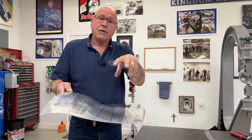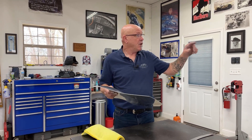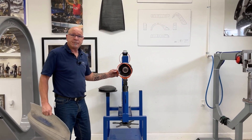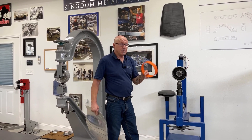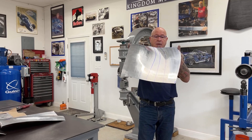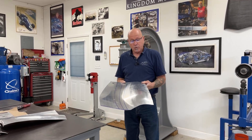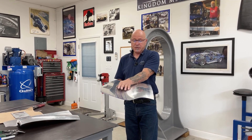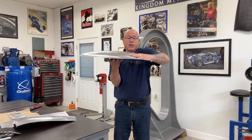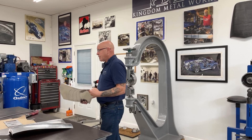That's not the only way to do this — there is another way. Maybe towards the end I can really true this in and utilize the Mittler Brother wheel with the urethane band on the top wheel. That will be for the next video where we can talk about the urethane band and the English wheel and how it changes things. I hope you're enjoying the video — you can see where the catwalk is starting to come in, very basic first stages. We're just going to go from this first stage into the third stage. I'm needing more stretch now on this edge to throw this over more. I hope you enjoyed the video — catch you next time. Bye bye.